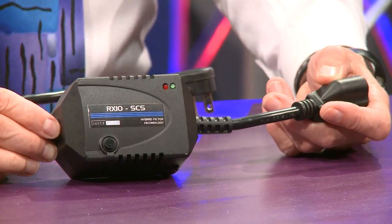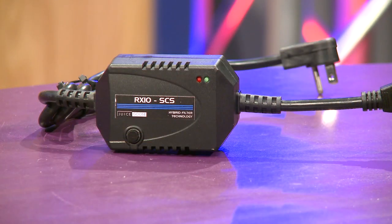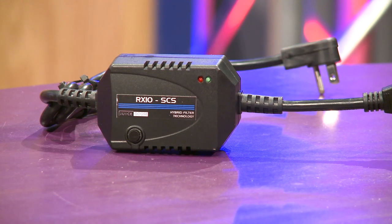Surge protection on normal mode at 10 volts is more than enough to protect equipment against any kind of dangerous surges, lightning strikes, things of that sort. And the 1/2-volt surge protection on the common mode, that is the ground line, provides plenty of protection to allow processors to do the work they're supposed to do and not be interfered or confused with surges on the incoming line. It's great for video projectors. It's also great for video monitors and any kind of single component that requires extra clean power.